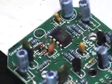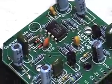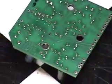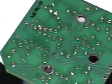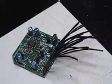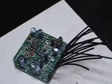And I do use the JRC 4558D chip. And I put every piece in by hand, solder them all up, clip them. All done, one piece at a time. Eventually I end up with my board and all my wires locked in and loaded.